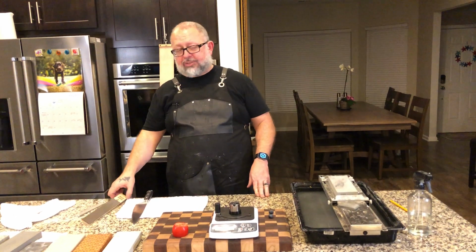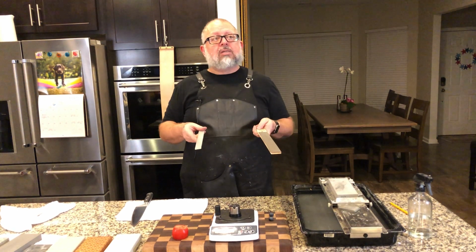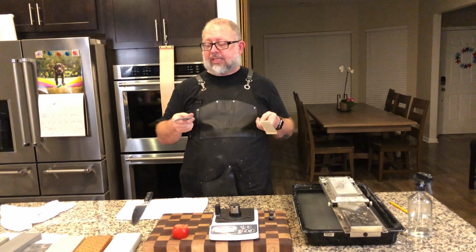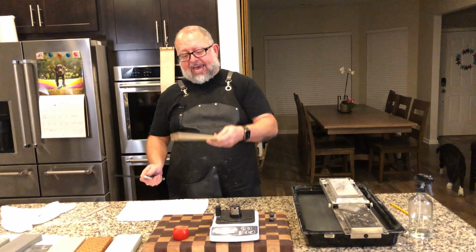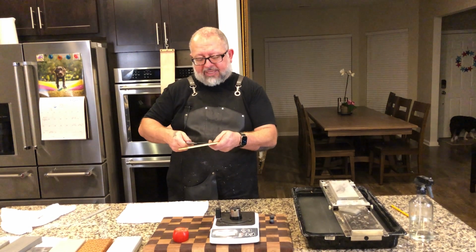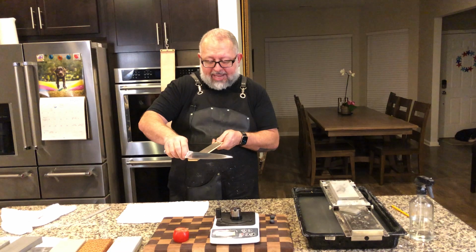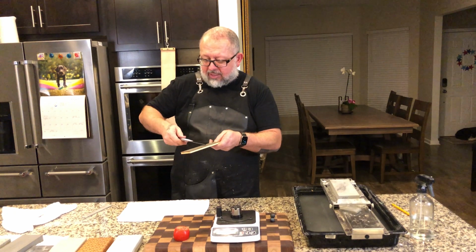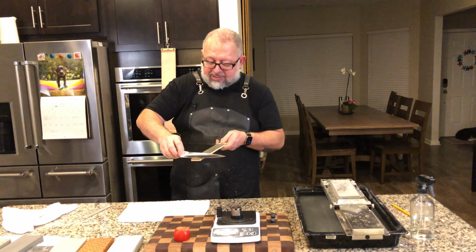So we are now going to take this. We have two strops. I have nano cloth and this, both with 0.5 micron. I'm not trying to talk too fast. I just had the phone call from the airport for my daughter. I apologize. So now that it's flat, we're going to keep it at the sharpening angle. We believe we've already removed the wire edge. So now my goal is to actually clean up the apex. I don't need a tremendous amount of pressure here. If I put too much pressure, I'll actually roll and soften and mushroom the edge that I worked so hard to get.